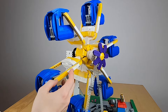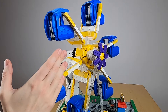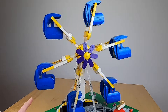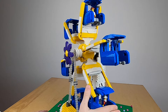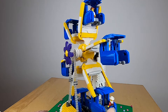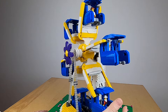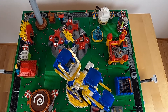In the future I might make a more bulky design for these arms — they are quite thin now because I want to make them as light as possible. Most importantly, if I'm going to make a change to this module, it would be to add some kind of door or mechanism in the front that opens only when people are getting in and out, and closes when the gondola is up in the air, because it is a bit dangerous to fall out. You saw with the plane flyer module that it is possible to make a closing door, however that is also extremely difficult.